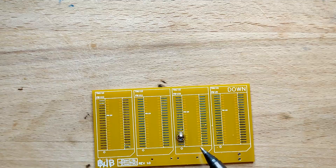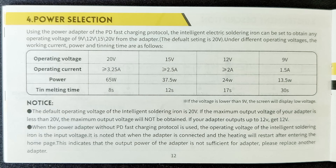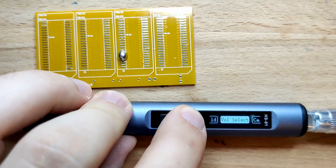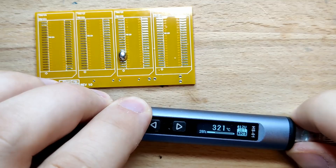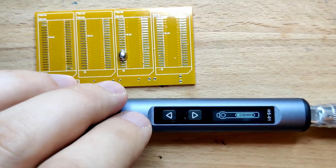Let's go through a few voltage settings. According to the marketing material and the manual, with higher voltages the solder melting time decreases. We have seen that the voltage can be set in the menu. Unfortunately, the voltage is not applied right away — I had to unplug the iron from the power supply and let it reboot before the new voltage setting was applied.